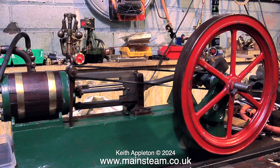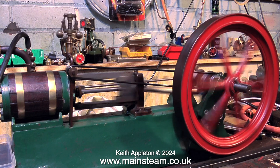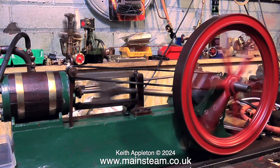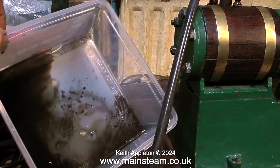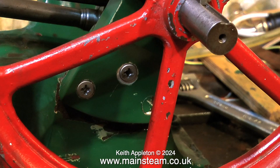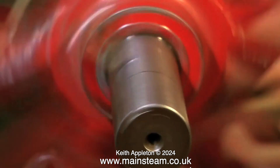Making a start — sometimes it's difficult, you don't really know where to start. I'll begin by running this engine so you can see how bad it is. The flywheel is not exactly spinning where it's supposed to; it's wobbling all over the place. This is mainly due to the crankshaft being bent, and the flywheel itself is not a tight fit on the shaft to start with. Here's a comparison with the Stuart Models Number 10, so you can see this really is quite a large steam engine. The first thing I'm worried about is the nasty black stuff coming out of the exhaust, and also the way that the main bearings are mounted to the bed casting — one of them actually moves as it's running. The worst part though is the bent crankshaft.